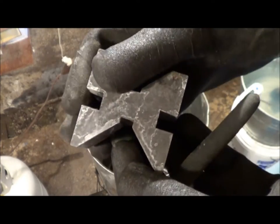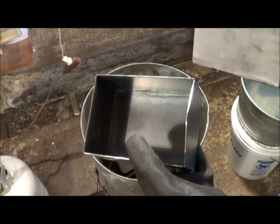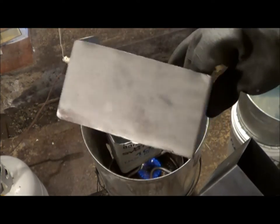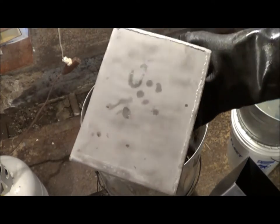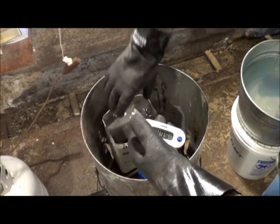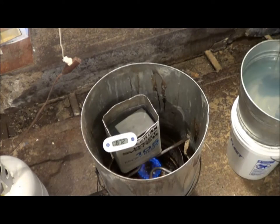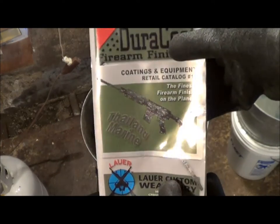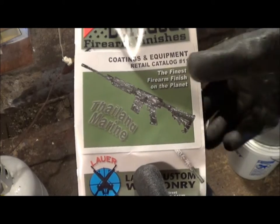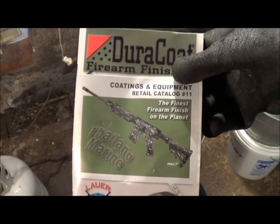Got like a white film on there. I think we're ready to throw a trail cam box in. This one is not blasted — it's kind of a darker color. This one is blasted; I'm not sure of the media, not soda, probably sand. So when that comes out, that should be a lot darker. If you've heard parkerizing before and are wondering what it is — old guns were parkerized after they were case hardened. Basically, the parkerizing accepts the Duracoat finish a lot better; it gives it something to stick to and helps it bond with the base metal.